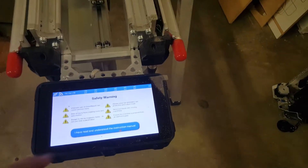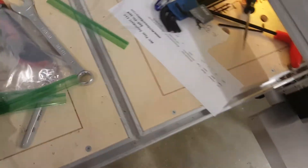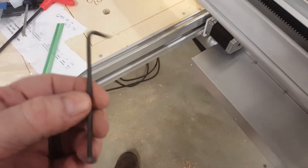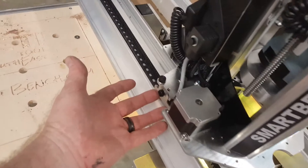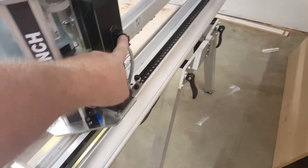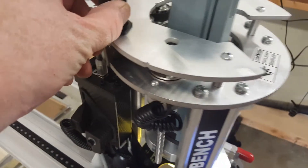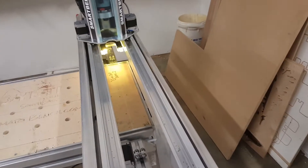Letting it boot up — I haven't changed anything on the console. I'll enable auto square and get my tools out of the way. You have to press the home button again after it finishes the sequence. The hookup was really just connecting power on both sides and screwing them in. The speed control plugs into the USB port here, and the main power is now a short cable — the previous version was hardwired in. It'll do the auto square, banging against the stops, then bring back down to the console end.